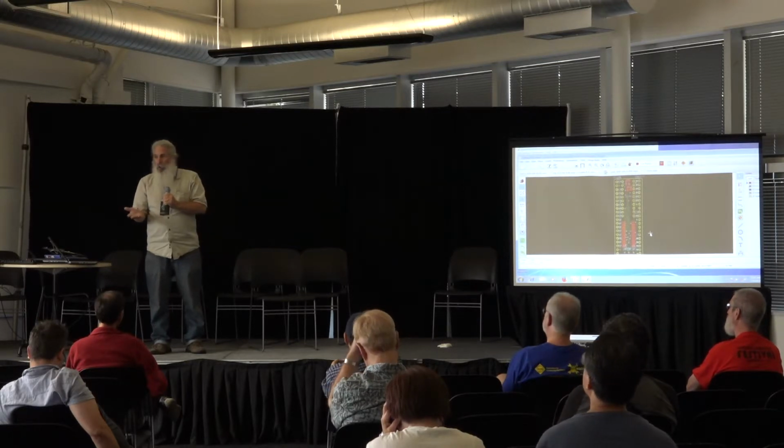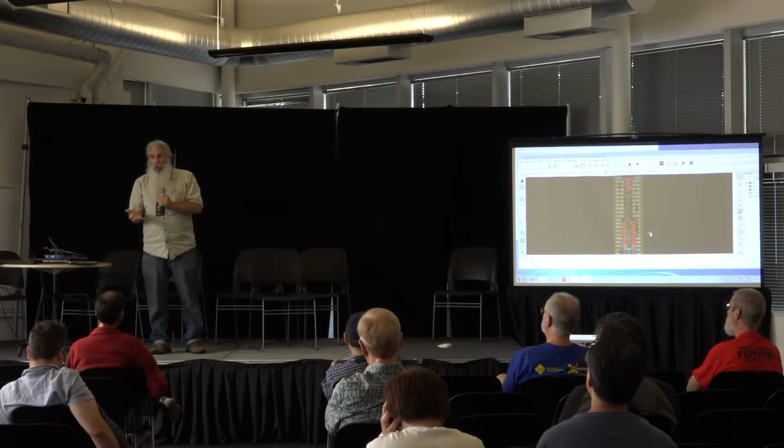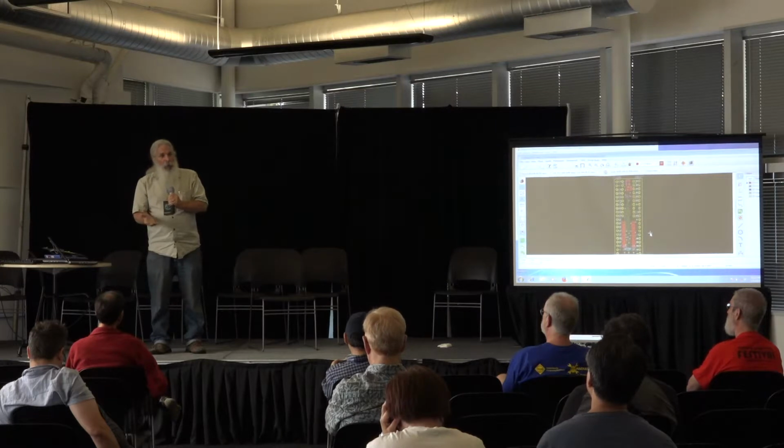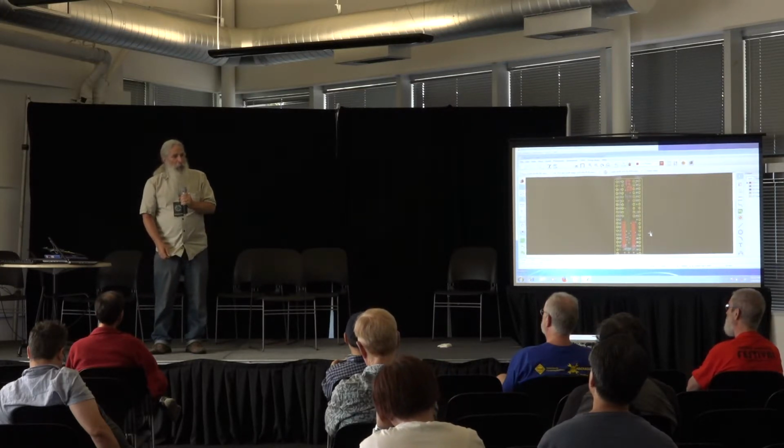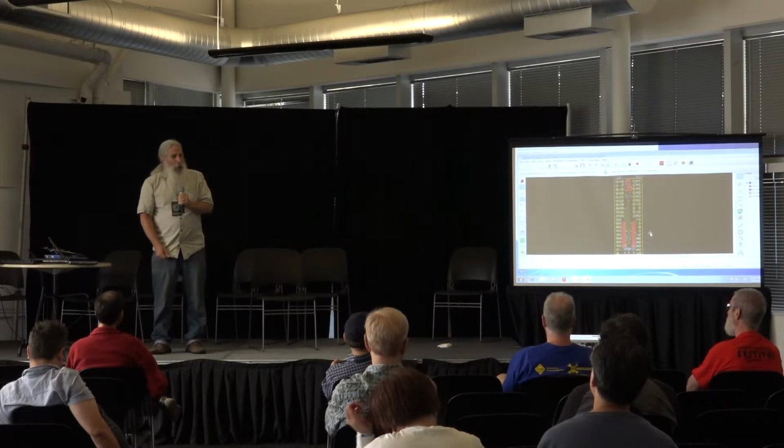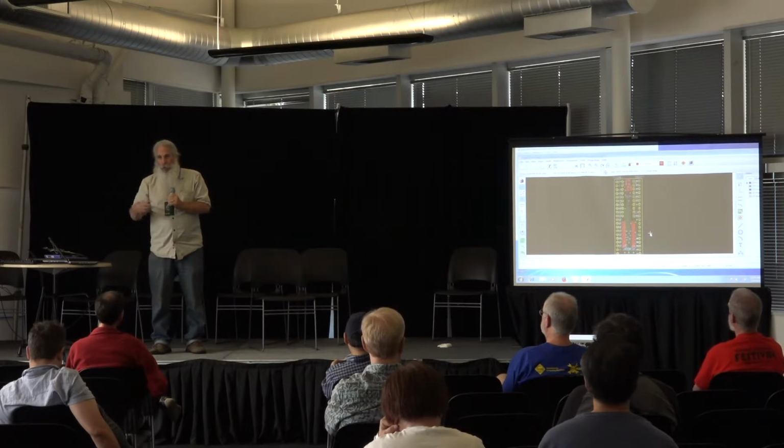They think, well, I put 10 layers, maybe I'll put 12 layers in there. Actually, you'll find that you may not be able to route a 12-layer board because you've already used up too much space for the feed-throughs. The feed-throughs take a lot more space than the traces do. So you have to be conscious of that as you're working along.